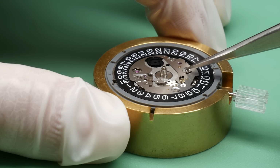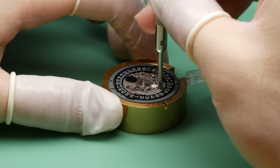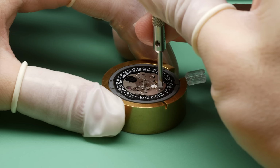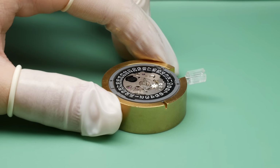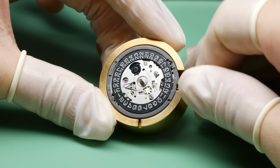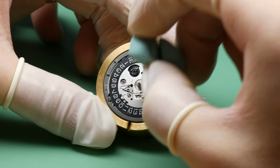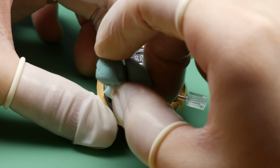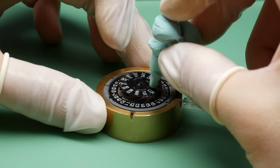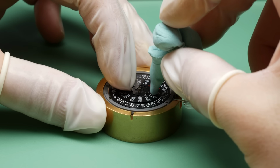Each screw is loosely installed, then once all of them are in place, I tighten everything up. I promise this advice isn't from an IKEA furniture manual, I picked it up from a JLC master watchmaker. Before I even get to the dial, I always check the operation of the date wheel that was just installed. Checking as you go is a good practice to follow since you'll be able to detect any issues in a shorter span of time. Of course, I give the inner plate and date wheel a thorough cleaning prior to installing them since I won't have access to these areas afterwards.